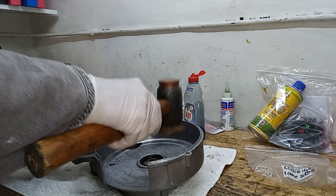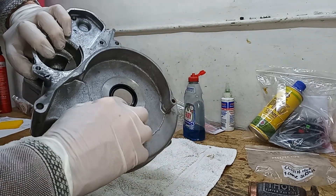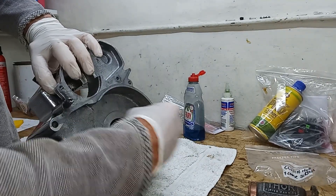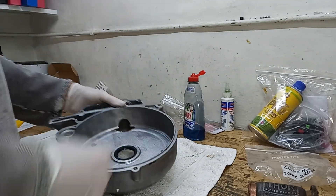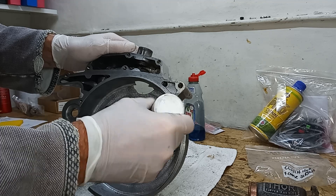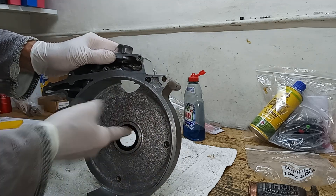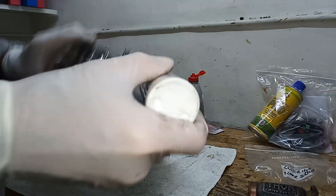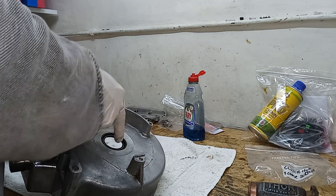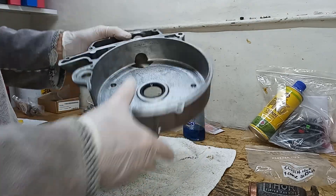That just taps in like that. The spring, the open side, needs to face outwards because it's to stop all the crud coming from around the gearbox pocket and getting in. We'll put a bit of lube on it, because this seal normally runs dry — there's no oil either side. It doesn't matter too much if it wears out a bit because it is just a dust seal. If it was an oil seal it wouldn't happen, but running dry it will slowly wear the lip.